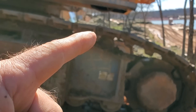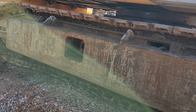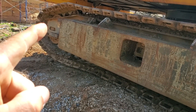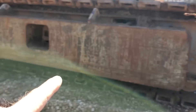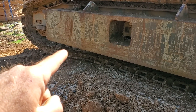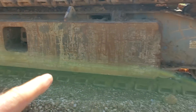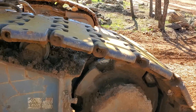This section of the track is under tension — all the load of the machine is right here on this section of the track. And all of our slack is up on top, and that's where you want your slack to be — up here. If our crawler frame or our final drive was on this end, then all of our load would be up there and our slack would be bunched up right down here. And that's why you don't want to do that — because if you get your slack bunched up down here as you're coming down, that slack can jump a tooth on the final drive and really do some damage to the finals.